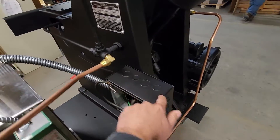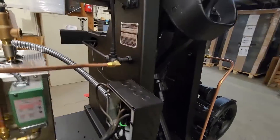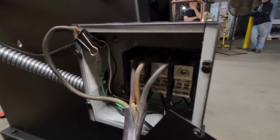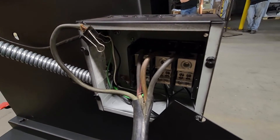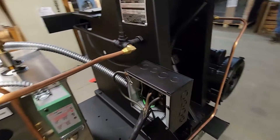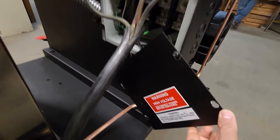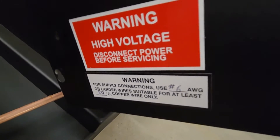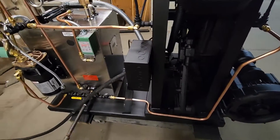The next thing we need to do is hook power to the machine. Over here we have an electrical box with plenty of knockouts all the way around and some available on the bottom. We have the box open so we can show the distribution blocks inside. Hook it up however your particular power requires — this one is single phase, but we also offer three-phase. This must be done by a certified electrician. There is also a label on the box that calls out the wire size required, and if it's a three-phase machine, it will say so on the panel.